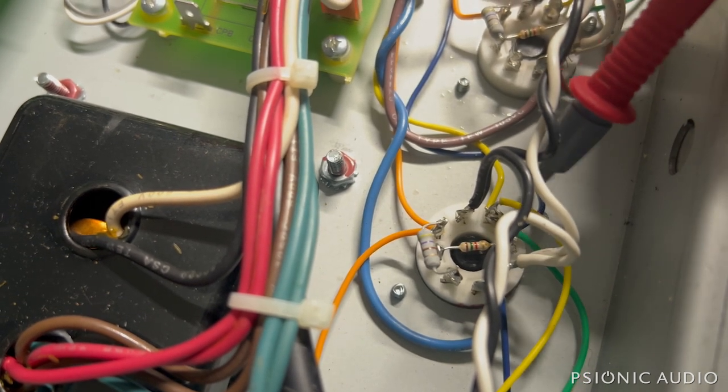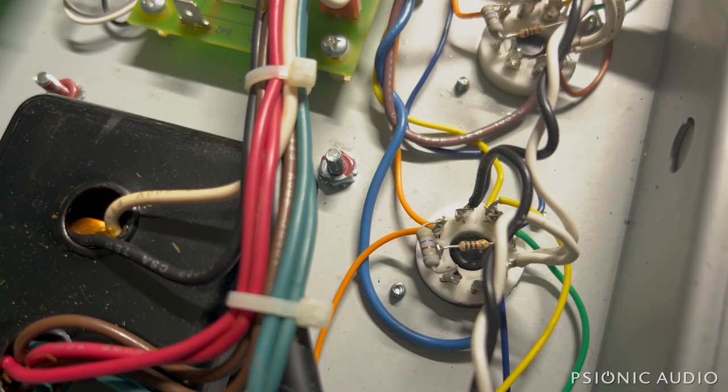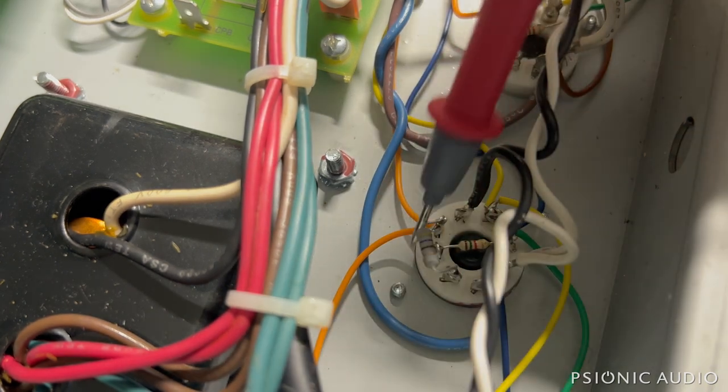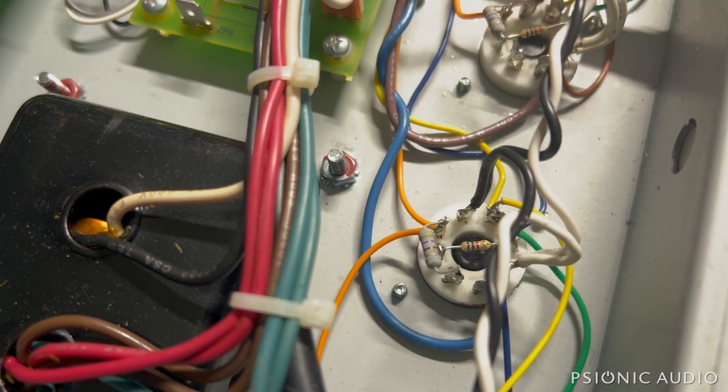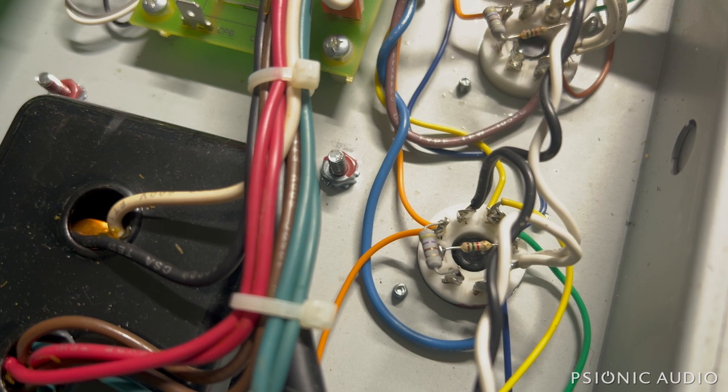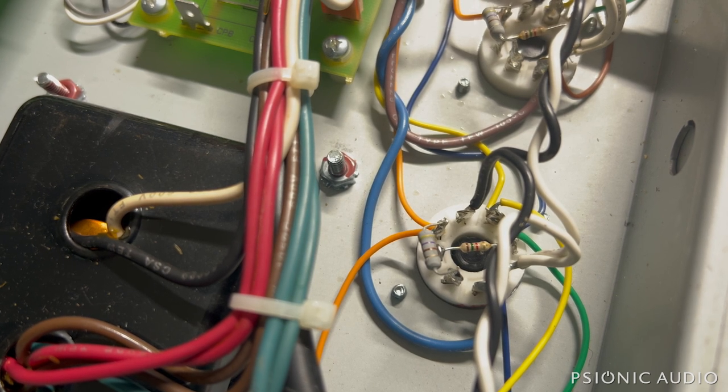So that all seems okay. There doesn't seem to be any hidden gotchas in here, so I don't think we're going to have a problem that'll hurt a new tube. I think we just have a problem with this one tube and its mate — these two are paired together. This one was just fine, so it's not a problem with the bias on that side. It's just a problem with one bad old SovTech. Order some new tubes, pop them in there, bias it, all should be well — but we'll confirm.